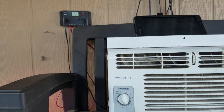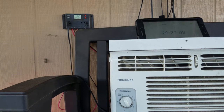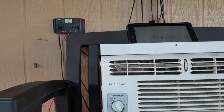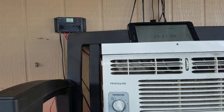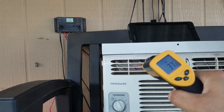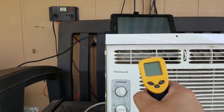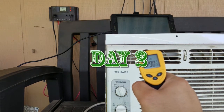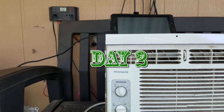This next one is from Monroe: 'You're taking 576 watts out and only putting 150 back in. It will take you a week to recharge the batteries after they are dead for a few hours. Also 12.5 volts is full charge, 12 volts is a dead battery, and anything under 12 volts is a damaged battery.' This actually took me one full day to get the batteries back to full charge — one full sunny day. I don't know what it says on paper, but with the Harbor Freight solar panels it took me one full day to come back from the dead battery.